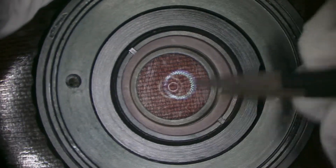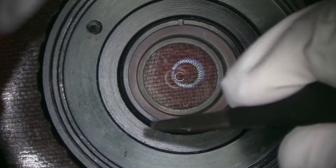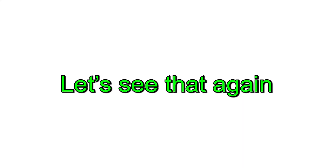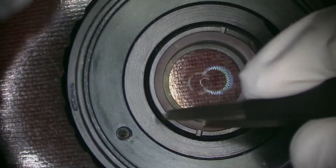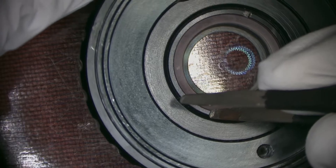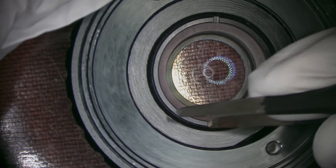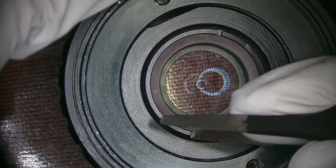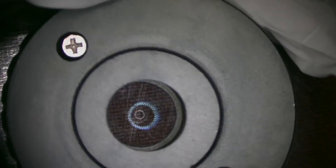I'm just inspecting and making sure I got all the dirt off. You'll notice the two lenses together actually magnify slightly when I pick it up — you can see the texture of the board underneath. Then I used a big pair of flat tweezers to bring the ring in the rest of the way. Don't over-tighten it or you'll damage the glass, but you do want a little bit of pressure — kind of like a screw into plastic. I go back and forth between each side to make sure there's even pressure.